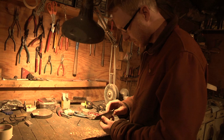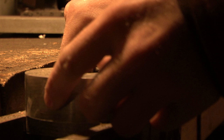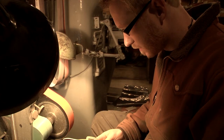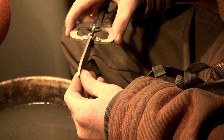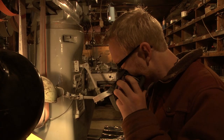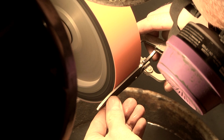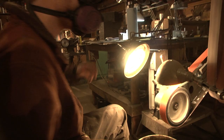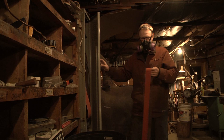This is how I scribe the blades so that I have a line down the center, and then lines to grind through. I used to build a custom handle fixture for each new knife but I found I just like vise grips better — it gives me a bigger platform and more sensitivity on controlling my angle. I first started making wooden knives; my dad had me cut out wooden blanks and I'd grind those until I could get them straight, then started on mild steel — grinding and grinding until I could hold straight lines, keep an even bevel, and finally was able to grind a knife. Now it feels second nature. It took a lot of scrap metal to finally get a bevel to come out straight.